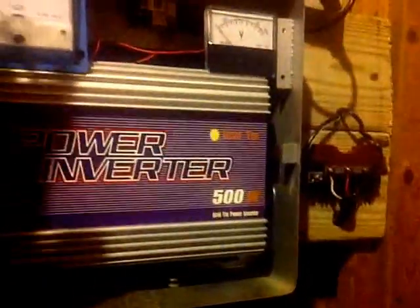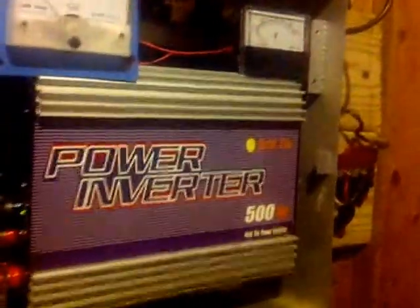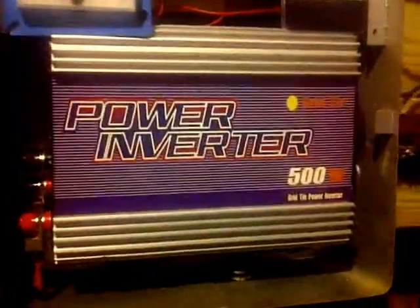As far as the electrical goes, I put an outlet in with my kilowatt meter, and I do have a dedicated line going through the shed. I have 240 in this shed — one part runs my shed, which is some lights and a little outdoor lighting. The other leg I hadn't used, so I took that leg and used it for my grid-tied inverter. It goes straight back to my electrical power, and there's nothing else on that circuit but this inverter.